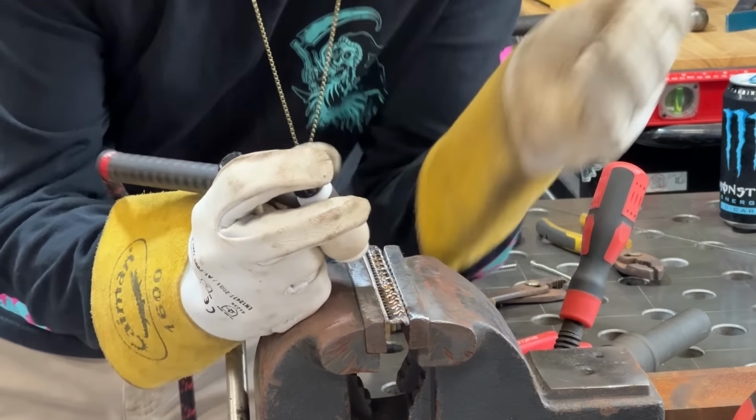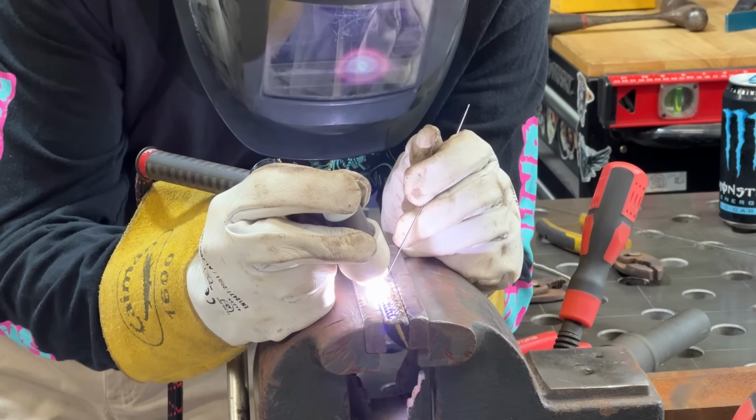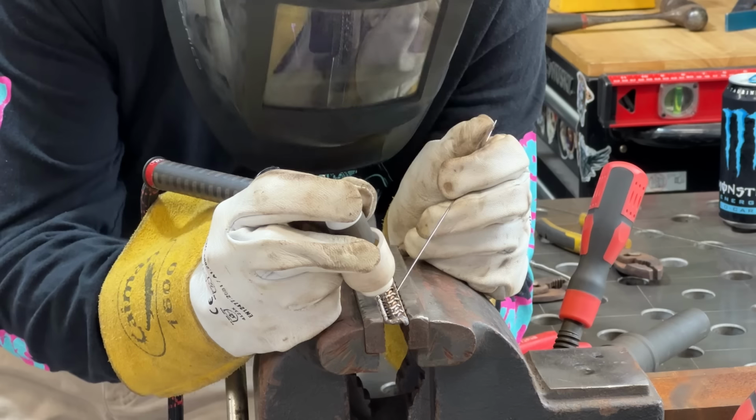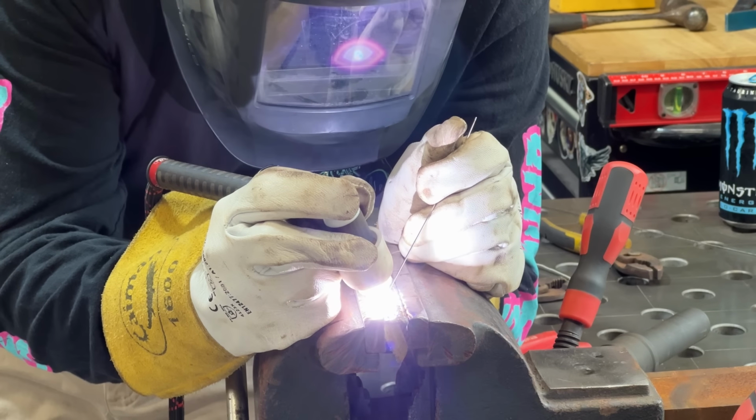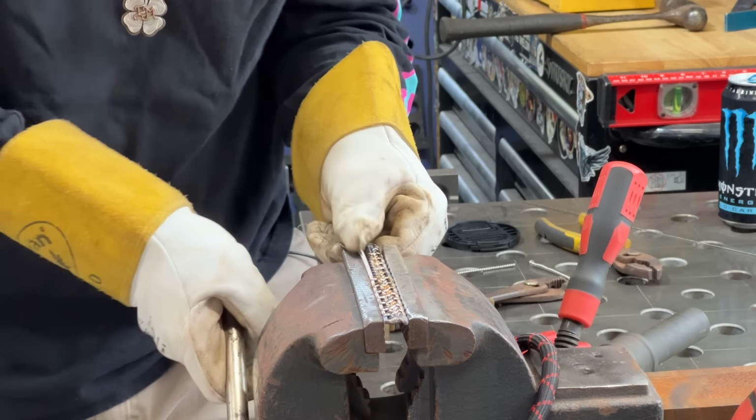Put the last piece on. The best advice I could give you when you're doing these is keeping everything really close and together. If you can tell, again, I'm easing into that foot pedal and balling up a little bit of this 045 wire until there's a ball where I want that metal, and then I apply the heat with the foot pedal. I do believe this is the cleanest way that you can accomplish these tacks. And it's not gonna happen on the first one. Most likely you're gonna ruin a few, because you probably suck at it, just as you suck at everything the first time.